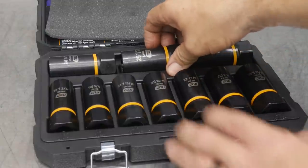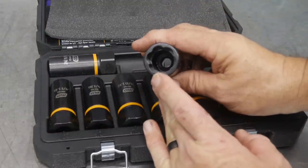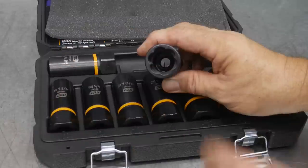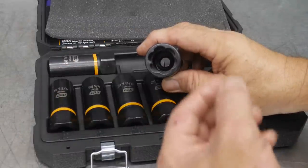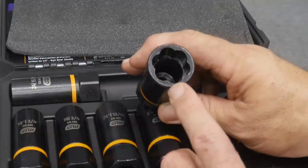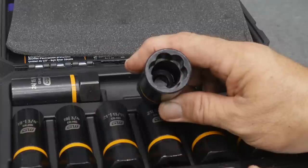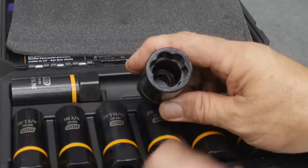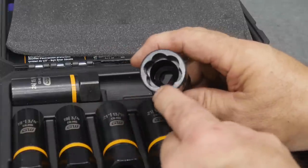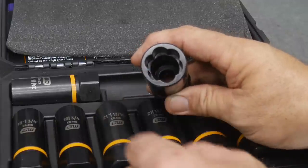If you're not aware of these Bolt Biter sockets and the differences, if you look down in here, typical bolt extractors are typically fluted and they have a spiral to them — in other words, they work for loosening only, typically. In this case, we have a straight flute design. You wonder how in the world is that going to work? Well, we're actually going to try that out. We've tried it before and it works rather well. But we're going to try it this time with an impact wrench. You can see those flutes — they don't have any type of spiral to them. They just go straight down.